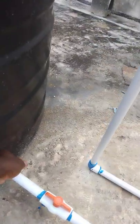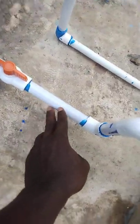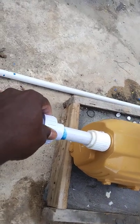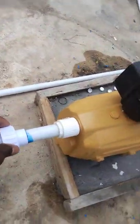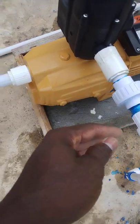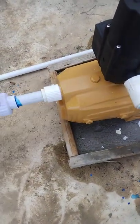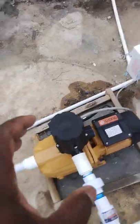If you weren't using a water pump and non-return valve, you would put it as close as possible to the outlet, but you would still put the lock-off before it. The water travels through this lock-off, comes up this elbow, goes through another elbow, then I have a socket union here. The socket union is there because if something should go wrong with the pump, you just screw off the socket union to detach the pipe from the pump. There's one on the inlet and one on the outlet of the pump.